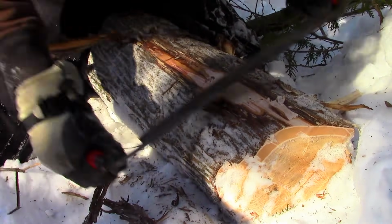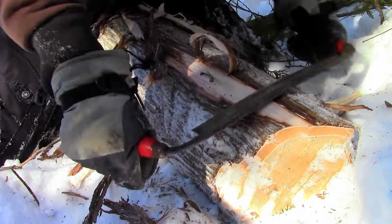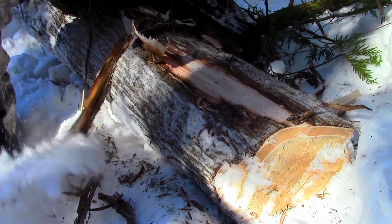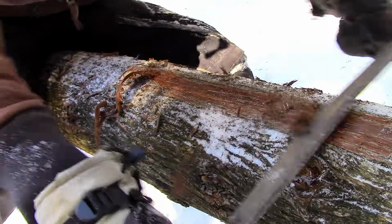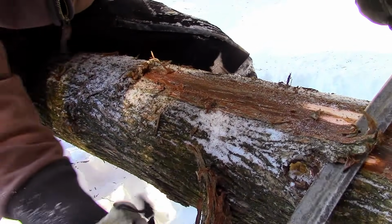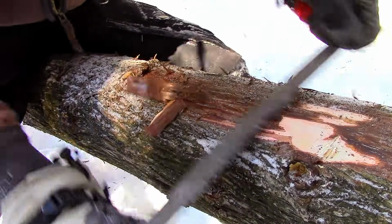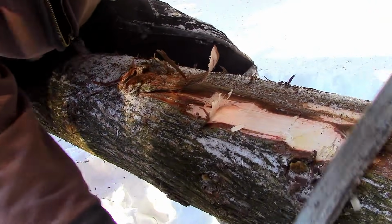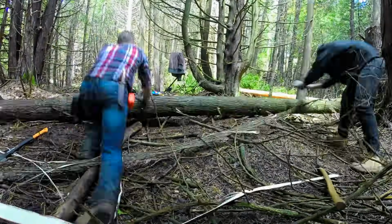Unfortunately, the bark was still extremely hard to peel. My draw knife was the only thing that seemed to work, and barely at that. Even after the outer layer of bark had been shaved away, I still had the stubborn cambium layer to deal with. The bark was so fastened to the log that I had to be careful not to accidentally shave or nick the wood underneath. I tested several different areas on the log, but they were all very difficult to work with. I quickly came to the conclusion that it would take several hours at least of painstaking labor to peel each log. This was a far cry from the 15 minutes per log it took in the springtime.